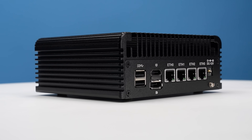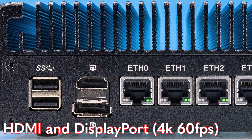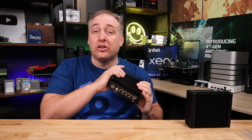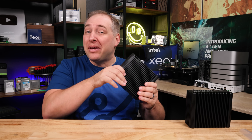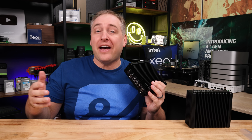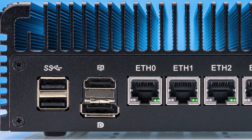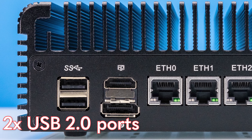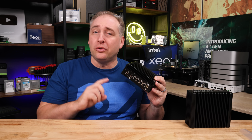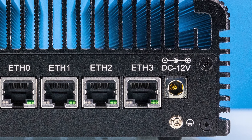At this point, most operating systems have adopted the drivers to handle these out of the box. We also get an HDMI port and DisplayPort — both of these can handle 4K60 displays. That's kind of cool, because something that differentiates this Alder Lake N-series processor versus some of the other processors in these firewall boxes — especially the higher-end ones with like a C3000 or C5000 chip — is that this has an integrated GPU because it's an Alder Lake generation part. There are also two USB Type-A ports on the back, though we also found these were only USB 2 ports, which is a bit of a bummer. The other features are our grounding point as well as the DC 12-volt input.